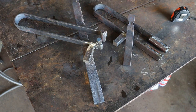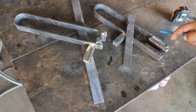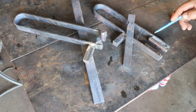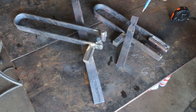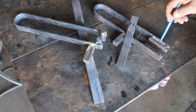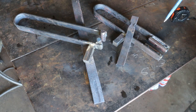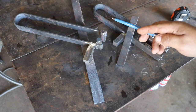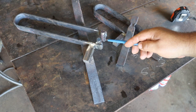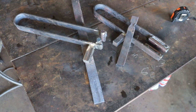Types of spring fullers worked great. Now this one bent almost immediately right there, just a little bit, but everything stayed straight. That sounds weird, it bent but it stayed straight. The fullering dies here stayed aligned, so that's all that's important. So we got a nice even fuller on there. This bad boy right here, it put a fuller on both sides of this stock.